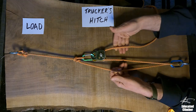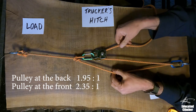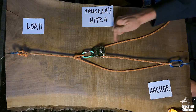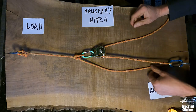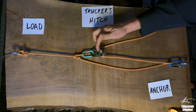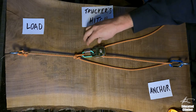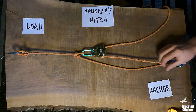So we just went from a 1.95-to-1 mechanical advantage to a 2.35-to-1, and that's because you can think of this as a chain, where my input force is traveling through the chain. Each time it goes through a link in the chain, it gets cut down. My best bet for getting as much force transmitted all the way through to the end of the chain is to not cut it down low right at the beginning. I should have my most efficient hardware up front, closest to my input, and work backwards from there in order of efficiency.